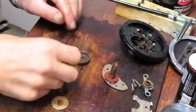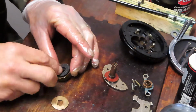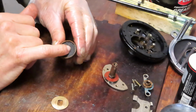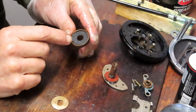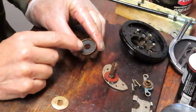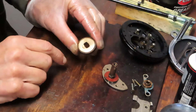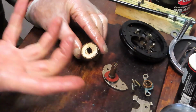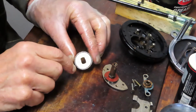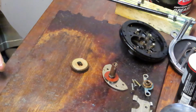Okay, so I've returned. I found a Penn HT100 drag washer, and doing a quick test, it's just a little short of what the other piece was in circumference, not terribly, but enough that it's going to do the same thing that the other main gear was doing in terms of the washer. And we will have the slip with this one. We will also build it up so that we are outside of that little cup on the side plate, and we will be able to have the function of a drag washer as opposed to this press down piece going on here.